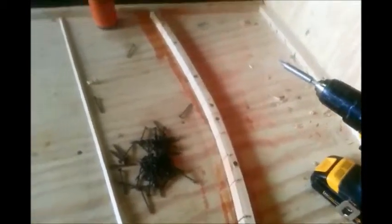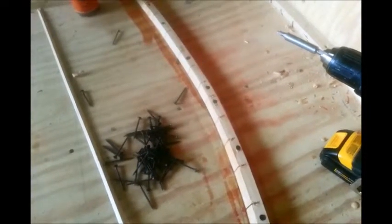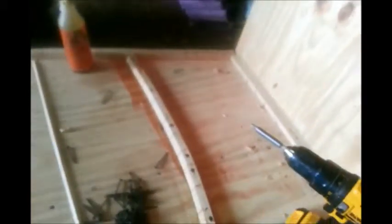This is all we're going to do on this portion for right now. We've got our two stringers in place. When we come back after the glue has dried we'll scrape off the squeeze out — you can see how it's starting to foam up there, that'll bubble up quite a bit. We'll scrape off the extra, then swap out all these screws, come up from the bottom side so that's secure, and then we'll glue our lazarette in place and screw it into each of those stations.